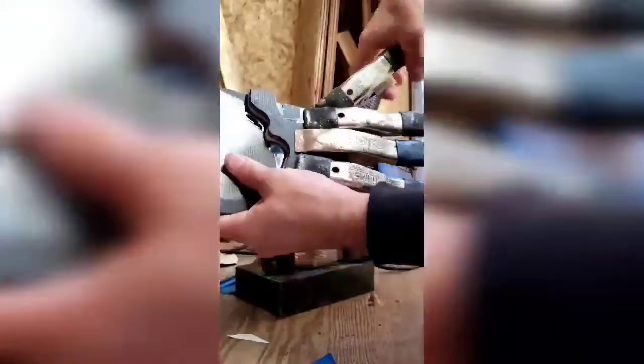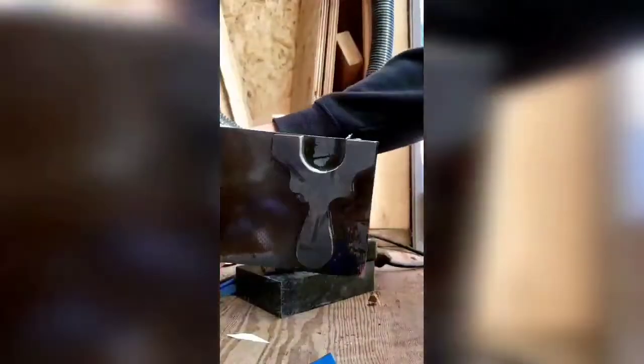So everything is dry after 12 to 24 hours, and I removed the clamp. You notice once again that I didn't have time to do it all at once, so I had to do each side a different day. Once that was done, I cut it out. I guess doing it this way does make it a little easier on the blades and tools rather than cutting it all at once, as I don't have a really big bandsaw.